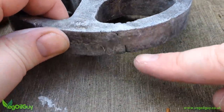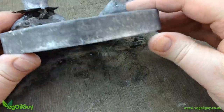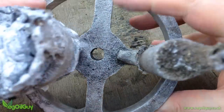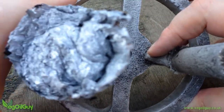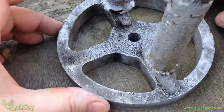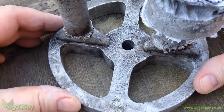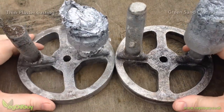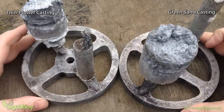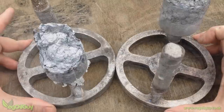There are also a few small tears. The central hole is fairly circular, but not on both sides. Still, it sat nice and flat, and when compared to a similar wheel that I'd made using my green sand technique, it was a good size match. Side by side, the thin plaster work isn't bad, but I think it doesn't match up to the sharper detail and crisper lines of the green sand example. But you decide for yourself.